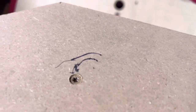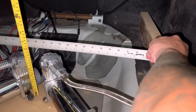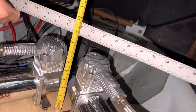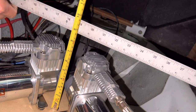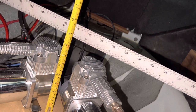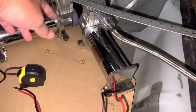Go ahead and do that all around, then do another test fit again. We got the two-by-four standing up and the ruler, and now we're just going to measure how high we're going to make the back coverings of this bottom panel. The lowest part is about eight and five-eighths. We could probably make it about eleven-sixteenths — okay, so yeah, we got about eight and five-eighths but we're just going to make it eight and a half. We don't need the backboard touching the top floorboard, so it should be fine. It's on the two-by-four so it's not rolling.